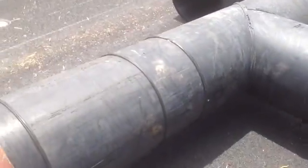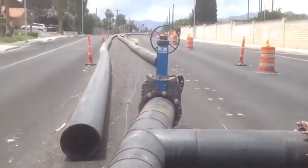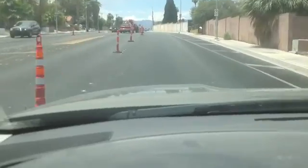This is how they join the pipes together. After they put this temporary pipe together, that's where the sewage is going to come down. The sewage is going to come down this temporary pipe, which will be laying right on the road. That will give them time to work on the existing sewer line that's in the ground — they're going to reline the existing sewer line.